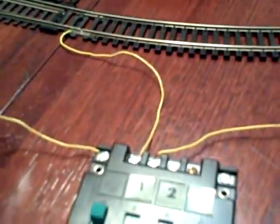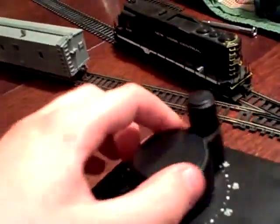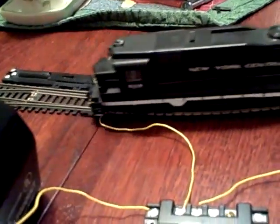The yellow wiring goes from the positive on both cabs. B cab feeds on the bottom where it says B, and A cab feeds on the top. Then it feeds out to each track feeder in each block. That feeder right there is set to A block — A cab — which is right there. So with my engine on A cab, when I get to the next block which is set for B, it stops.